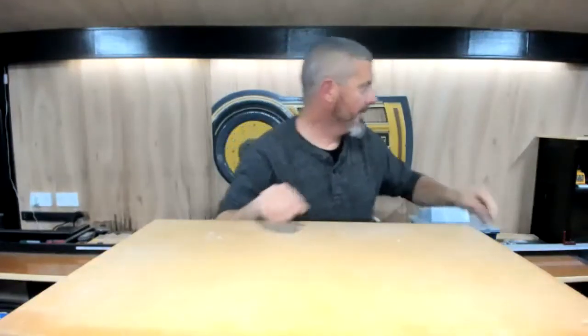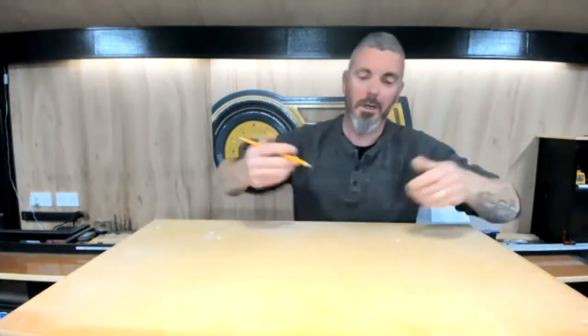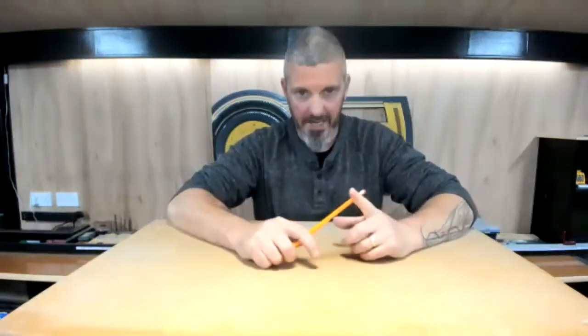Right, stain bleed now. There are two main types of stains that come through. One would be damp, and one would be knots in wood, in skirting board and things like that. You can attack the two of them in different ways, and I would recommend that you do. Some people say put 2 coats of undercoat on it and you're grand, but I don't.